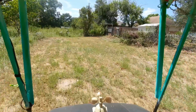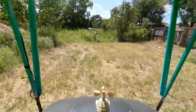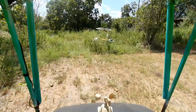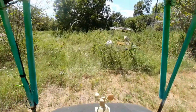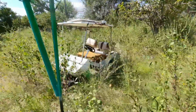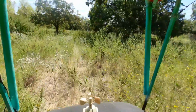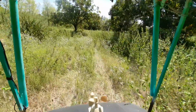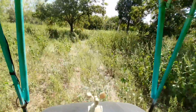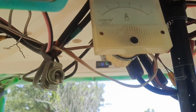So this other camera system, I'm going to keep it, but I'm going to move it closer to the house. It's a 36 volt cart that I converted to work on 12 volts. Right here we're coming up on. And it's got 2 cameras on it, 2 Amcrest cameras, and 1 AGM 12 volt battery, and a 100 watt solar panel. I have it pointed at the driveway right now so I can see, but that gate's locked, so nobody comes in the property anyway. But that's just my gate camera for the most part, and driveway camera. But it's gonna stay.